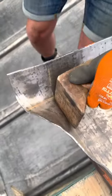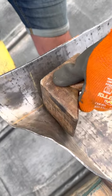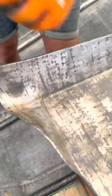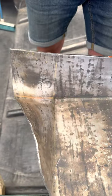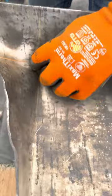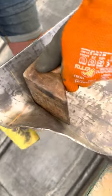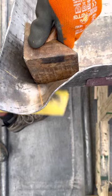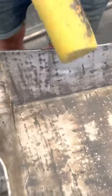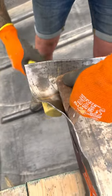Put that back in there. What I do from the back edge is just start tapping that edge up to about 50mm off there, 50mm up there. You start from there and then you end up with like a divot there, like a bit in. And then once you've got it to that height, all I do is bring that up. So if you look in there now, we've got a nice little slope up there with that round that'll sit on top of the roll.